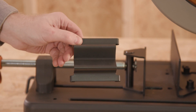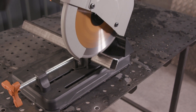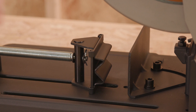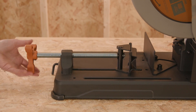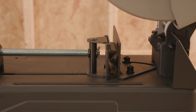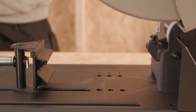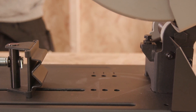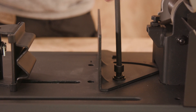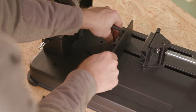When you need to swap out your materials, there's a handy quick-release vice. There's also a v-block adapter included, which is really useful when working with square tube or pipe — simply slide the adapter onto the vice and use the groove to secure your material. The saw features a three-position fence which can be moved to any of the three marked positions along the base to suit cutting both larger and smaller materials. To move the fence, take the allen key found integrated here, remove the bolt, and locate the fence in the desired position.